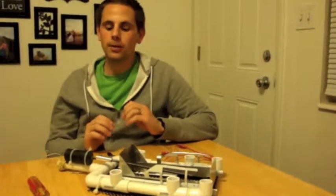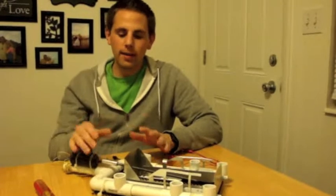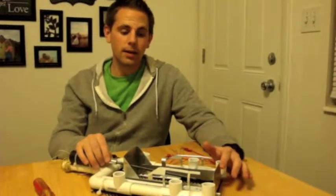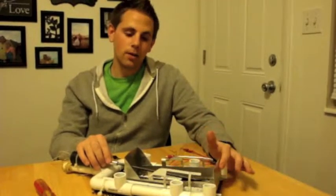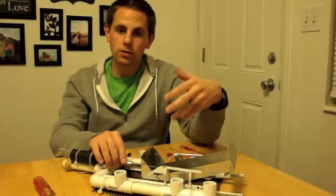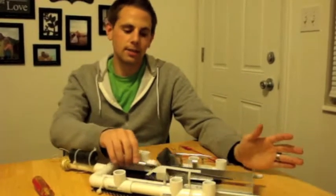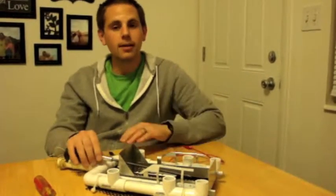The reason why I made the Sea Perch retrieval system the way I did is because I wanted to keep it as simple as possible. I wanted to make sure I only had one motor doing the movement of in and out. With that, the movement wouldn't be able to lift up the arm, so I needed another way to lift the arm as it was coming out. That's why I made these guiders — to lift up the arm without any other motors, solenoids, or stepper motors, and it would just fall due to gravity over the object.